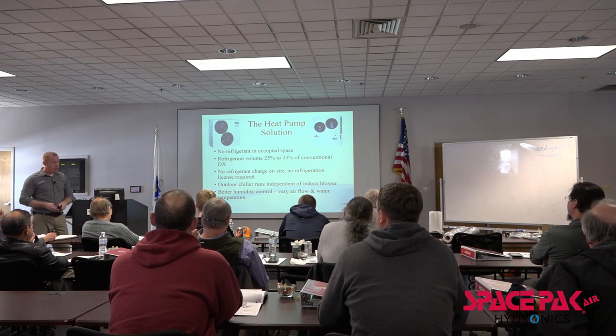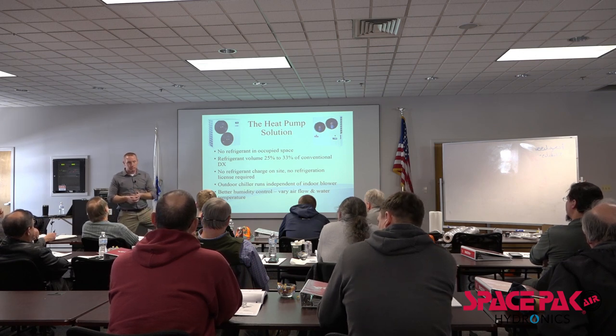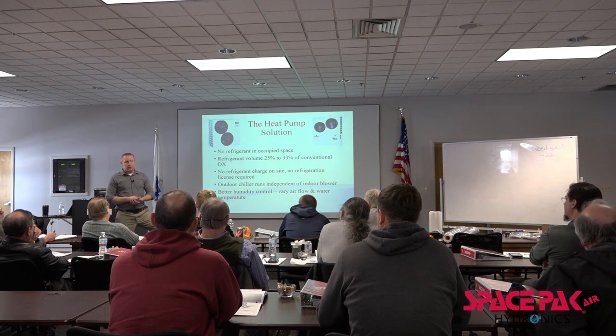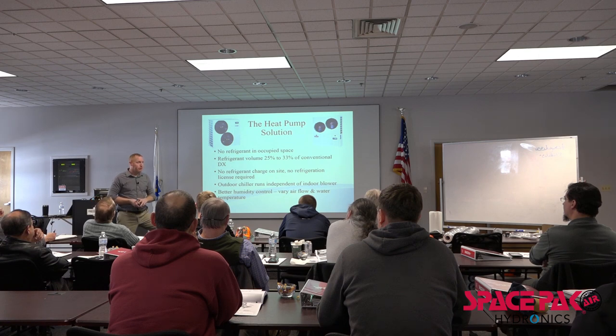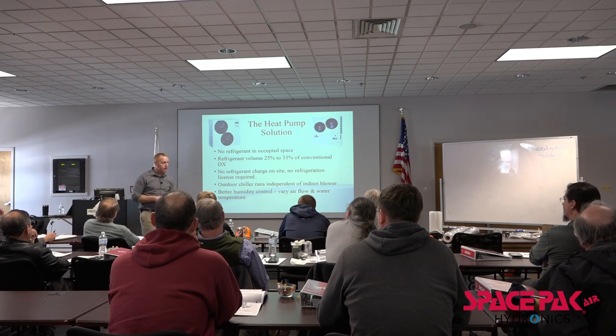We have better humidity control. So why would we have better humidity control when we deal with cool water? Any thoughts? Because if we're looking to remove humidity and not necessarily looking to drop the temperature, we can actually raise the water temperature, right? So we can dehumidify better. We can dehumidify better with, say, 55 degree water or 60 degree water as opposed to a DX system, which is going to make it 47 degrees, and you would get rid of that clammy cold feeling sometimes, maybe in a basement or something. Oh, it's 65 degrees in the basement, it feels clammy, right? Because it's still damp, it's still humid in that basement.